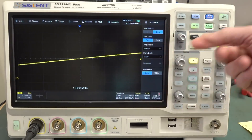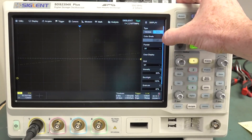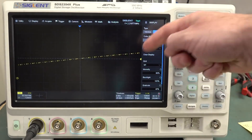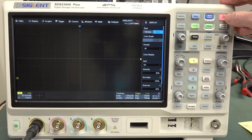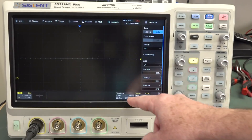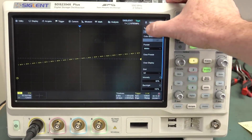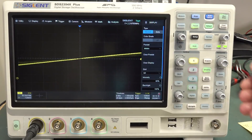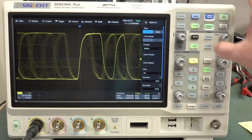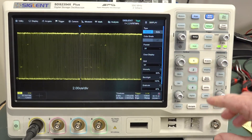Whereas the Siglent will only use 400 points, and it actually goes down to like 10 points right at 500 picoseconds per division — you only get 10 samples. It looks like there's more because it's not in dot mode. If we go into dots you can see those are the physical samples. It's re-triggering, so if we stop it you've only got 20 samples in there. They've decided that with all that memory, we can't use it the way you'd want — they've made the trade-off: history mode is always on.